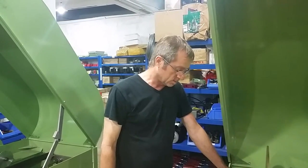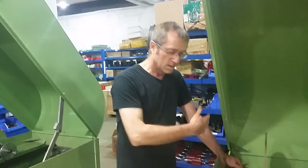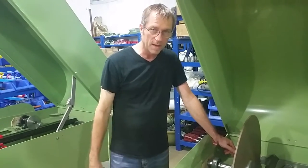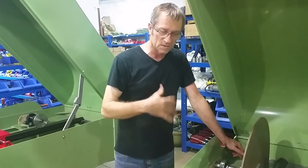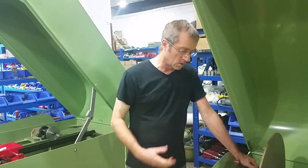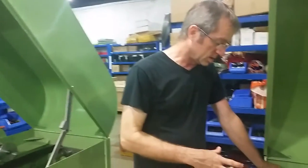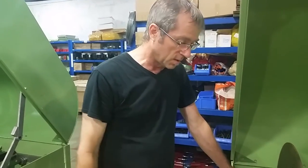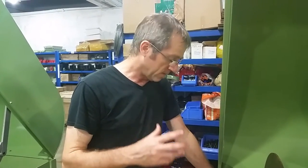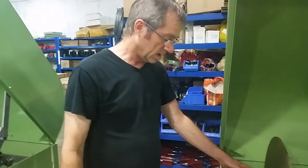Saw alignment is important because you are moving the carriage along a line that's not parallel with the blade. Sooner or later the blade is going to start getting dished. There are a fair amount of saws that don't have provisions for properly aligning the blade. So when we looked at the kind of saws we wanted to build, one of the things that's really important to us is to have a really good set of bearings and a set of alignment rails in our arbor.